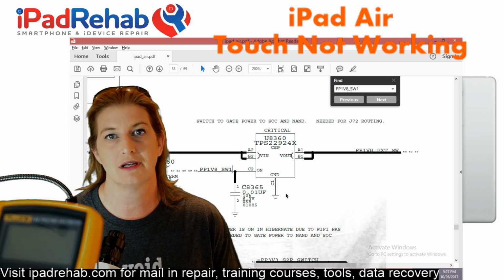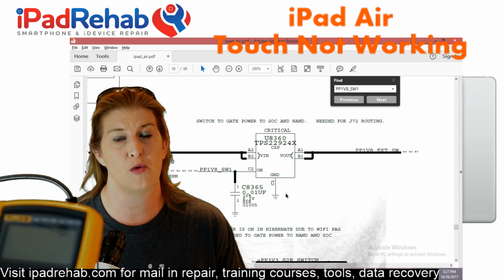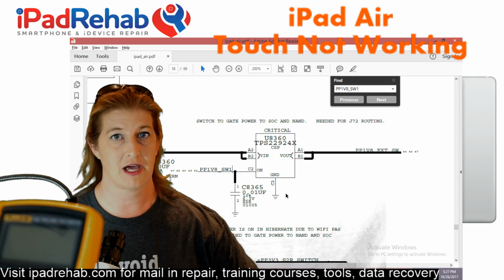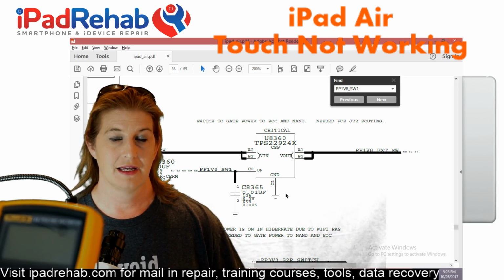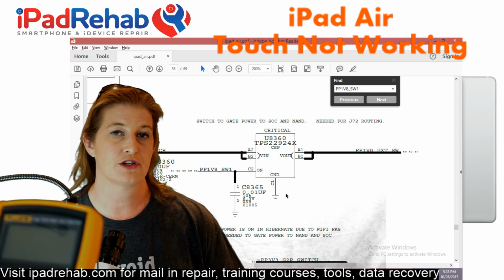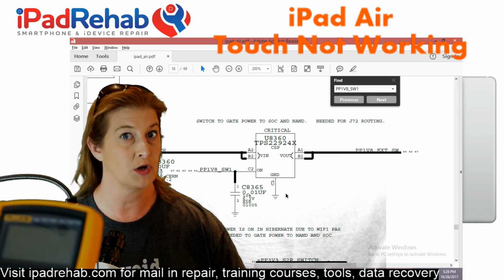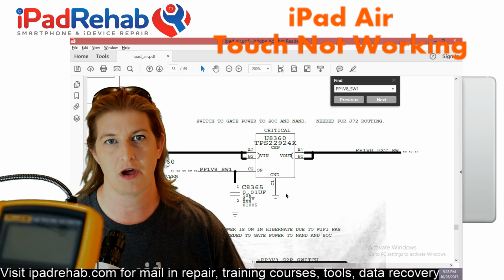So it was originally a red screen, no boot thing. He thought it was NAND. He took off the NAND, repaired the NAND, soldered the NAND back on, and he got this weird error 4014. The common knowledge was that if you take the NAND off and try to restore, it should get error 40. If it doesn't, then you might have some other problem. So he took the NAND back off and restored, and he got error 4014 again, even with the NAND off. So something else was going on, so he brought it to the course.